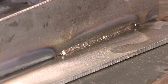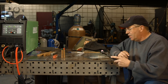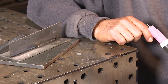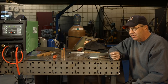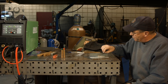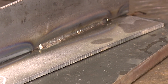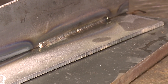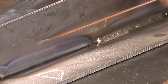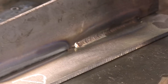I'm trying to show some machine capabilities here. We're running off the 4T program, which means to initiate the arc I'm pushing the contactor once, rocking the tungsten down and making contact with the material to initiate the arc, then I let go and it goes to my preset amperage. Not using a foot control, so if I had it set at 115 amps, that's what I was welding at the whole time. This first part I was dabbing the filler wire on the leading edge and kept it fairly low — decent profile. We're on 10-gauge material, eighth-inch thick, so we don't need a big weld. Had I gone all the way across, by the last quarter I would have had to increase my travel speed because of latent heat soaking into the part.